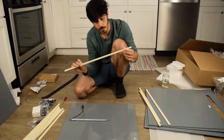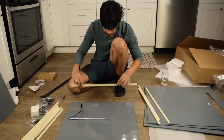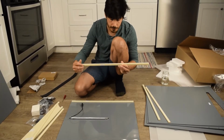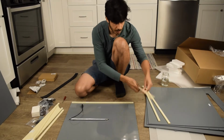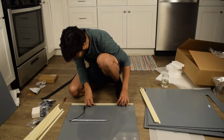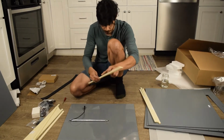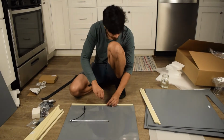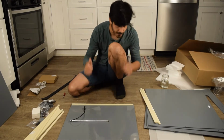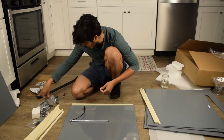There's a framing piece that goes to the top front. This framing piece is the only framing piece that has only 3 holes. It sits right there. All the rest of them have 3 holes in one direction, flip it up, 3 holes in the other direction. But the front piece has only 3 holes. So you should align it so that it's even on both sides. That looks like this is the right way. And I think it only goes in one way. Let's see, if we flip it the other way, then it's not even. So it only goes in one way. Make sure it's even on both sides. Perfect. So what do we use for these? For these we use the medium bolts or the 16mm bolts.